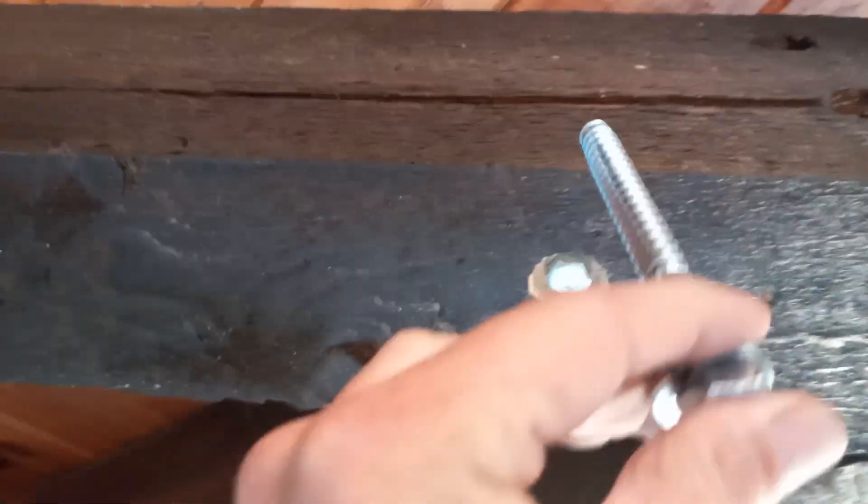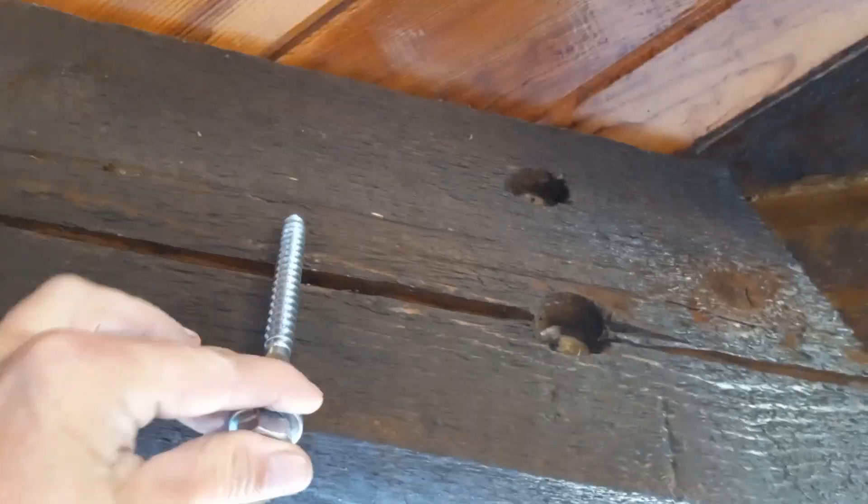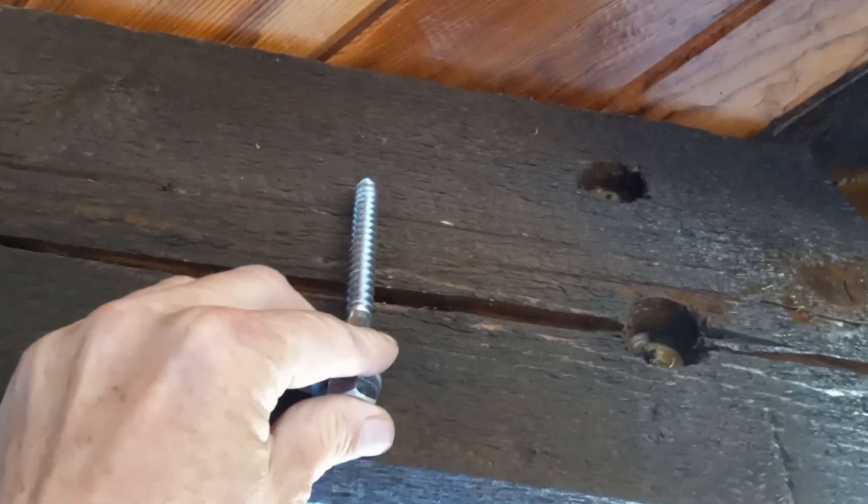So there's a bunch of the plates, and here are the rods to go up five, five and a half inches up into each beam and pull it together so it will not separate. See that one right there? These bolts are going that far up in there and holding that whole beam together. That one shot across because this is the structural beam all the way across.